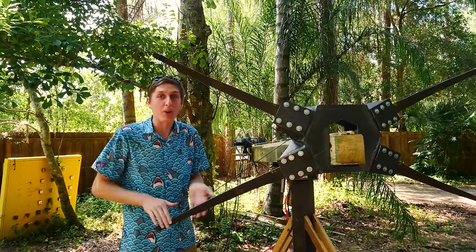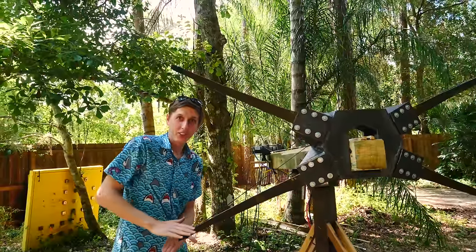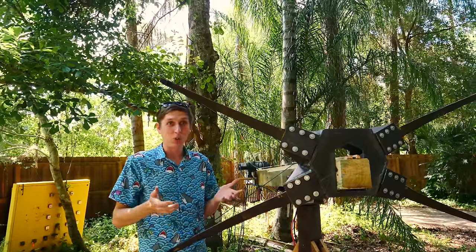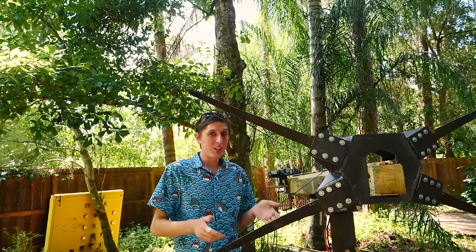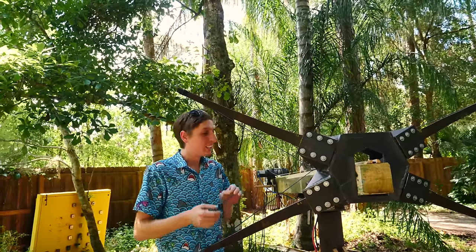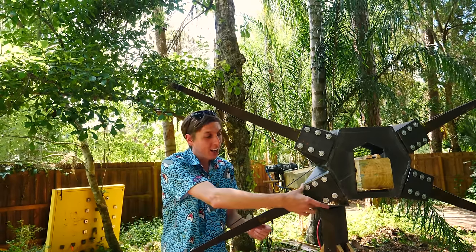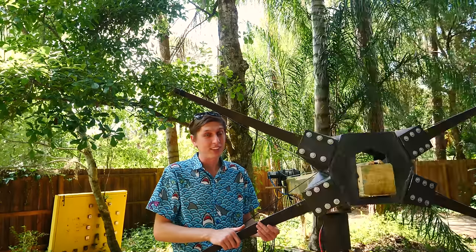Another thing I kind of want to mention is you notice how the arms of this bow have a slight taper to them — they're thicker at the base and skinnier on the top. This is because if I left them all one constant width the whole way down, when you bend it back you'd really only be bending part of the spring and all of the rest would just be extra dead energy at the end of the bow. So if you taper it, it allows the spring to store all of the energy throughout the whole curve of the spring. That's why in normal archery bows you always have the taper from bottom to top. I used a plasma cutter to cut it, and if you heat up spring steel too much you're going to destroy the temper and make it brittle. So I used a hose and sprayed water on the underside of the metal arm while I cut it with a plasma cutter so it wouldn't destroy the temper of the spring.